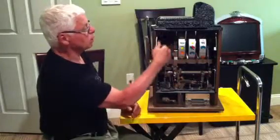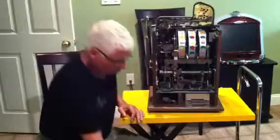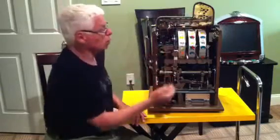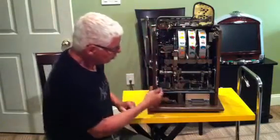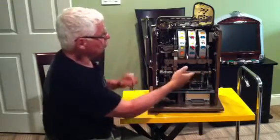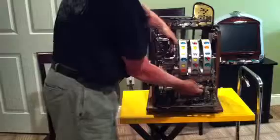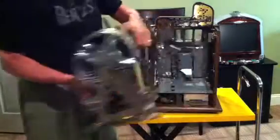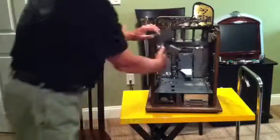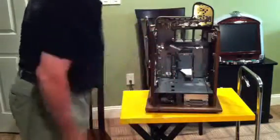Now this mechanism is easy to take out of the machine. You lift these two levers and lift the top off. Once you lift the top off, you can see the back of the coin escalator and how the coins get moved across. Now if you want to remove the mechanism, you lift this arm and this arm, and the whole mechanism will lift right out of the machine. You've got the whole mechanism out — you can send it for repairs or put it on a bench for repairs. And you can see the back of the bonus window mechanism and the inside of the machine.